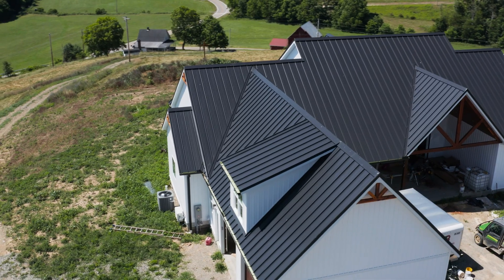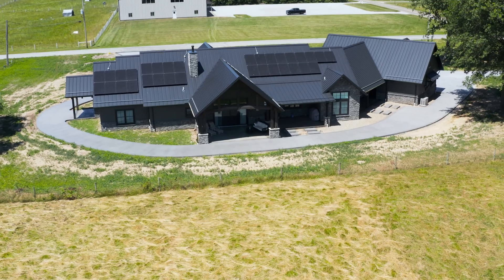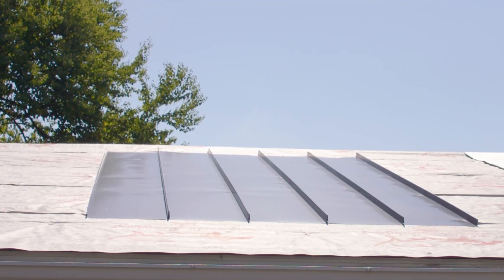The bottom line: can you put a standing seam metal roof over an existing shingle roof? Yes. But if you're spending good money on standing seam metal roofing — a long-term product — and you're placing it over an older roof deck that could have leaks or other problems, it could affect the longevity and lifespan of your new metal roof, create opportunities for condensation, and diminish the performance of the standing seam system. No matter what you choose, make sure whoever is installing the roof understands the potential pitfalls so they can help you mitigate them. Check out our other videos with practical demonstrations, comment below with any questions, and subscribe if you haven't already. Thanks for watching — I'm Thad Barnett, we'll catch you next time.